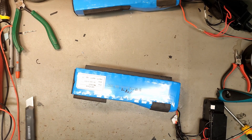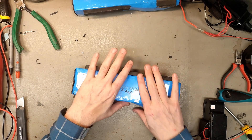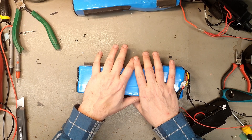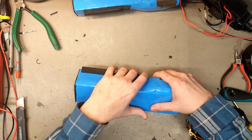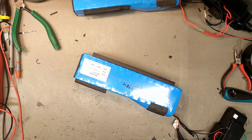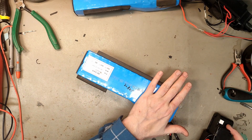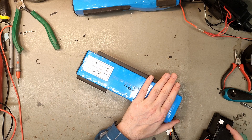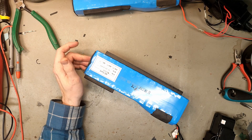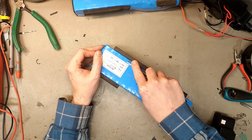Today we're gonna open up this battery, and the reason I'm filming this is because this battery has a fever. I just charged it up and it's not super hot, but it's definitely like 15 degrees over room temperature — and that is bad. Cells should really not get warm when you charge them. Either charging too fast or there's something wrong with the cells. This is a 4p battery and I'm charging it at 2 amps, so 0.5 amps — 500 milliamps per cell. That's not fast. So let's open it up and see what kind of cell it has.